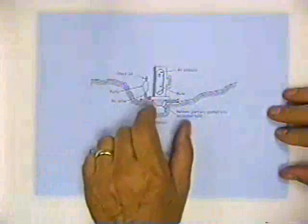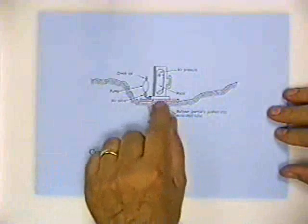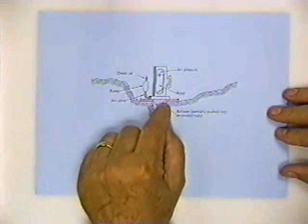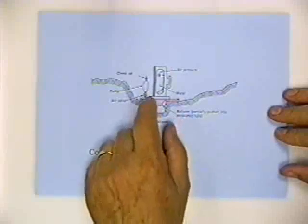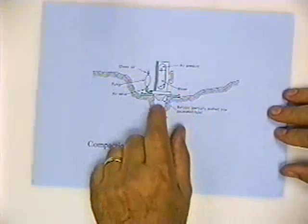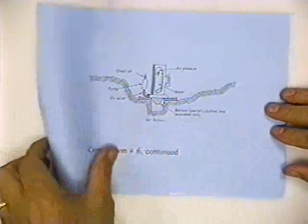That's one technique. Another technique is very similar, and here you use water. What you've got is a balloon. You dig the hole. You have a smooth plate. You put the plate down first. It is smooth. You take the plate off. You take your shovel and dig out the soil that you're going to weigh. You put the plate back down and put the water apparatus on it. You open a valve, and you measure the water that it takes to fill up that hole. So now you've got the volume, and when you weigh the sample, you've got the weight.